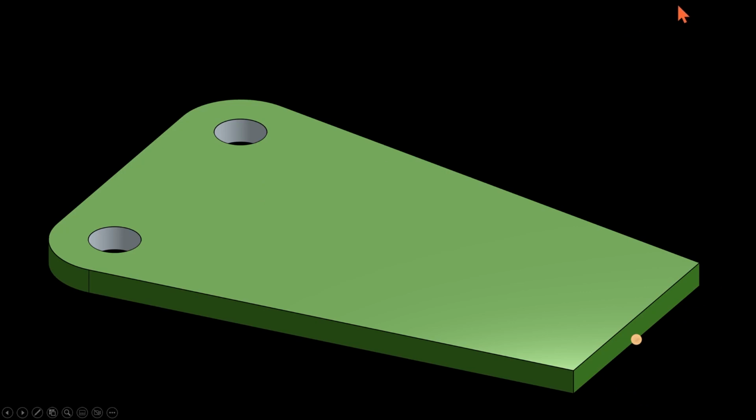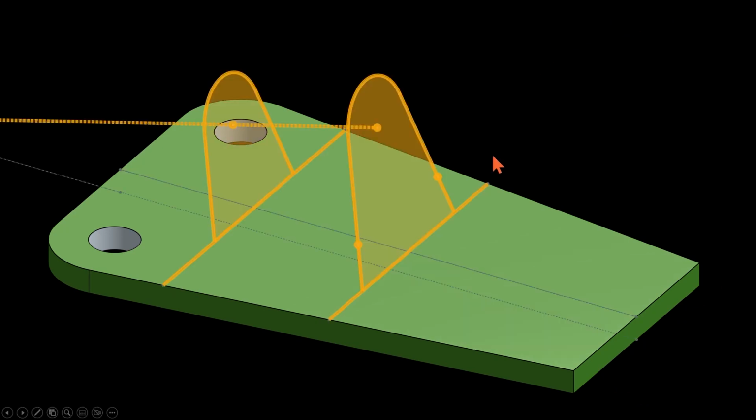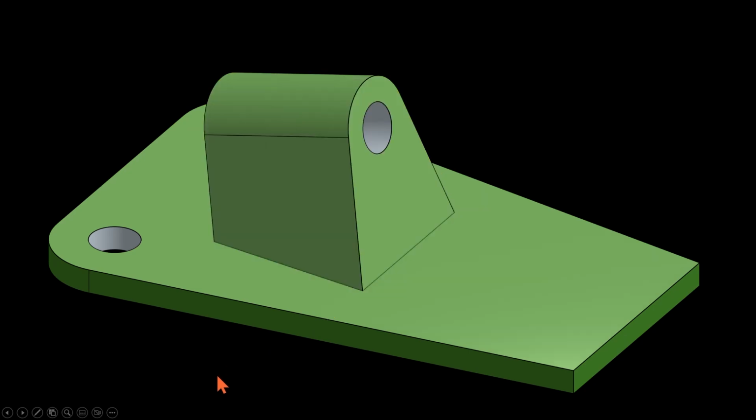We will build the base. We will build the line that is the center here at 15 degrees, put two construction planes on it, create the profile for the shorter of the two ends, and then project it forward and extend it to get the taller of the two ends. We will run a loft between those two to get the solid.